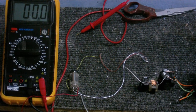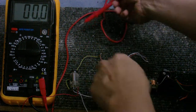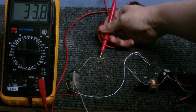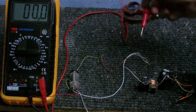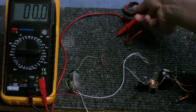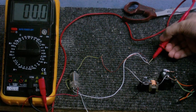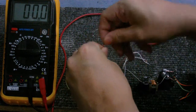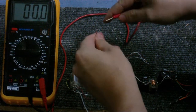I'm quite a tube noob — I don't really know much about these. I should, if I'm right, nearly have the full supply voltage at the screen grid. Taking a voltage measurement right now, you can see it's not exactly what it should be — it should be at least twice that, and it isn't. The actual supply voltage is almost 95 volts. And at the anode, 56 volts.